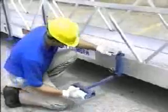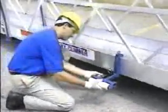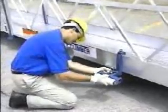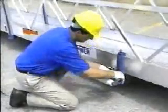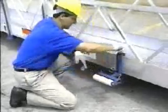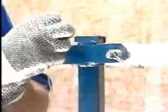Next, install the wall rollers. Begin by removing the pin and the square tube roller assemblies from the hanger brackets. Place the hanger bracket on the side panel's toe board at the desired location. Now, insert the square tube roller into the hanger bracket at your desired extension. Reinsert the pin and tighten the thumb screw at the top of the hanging bracket.